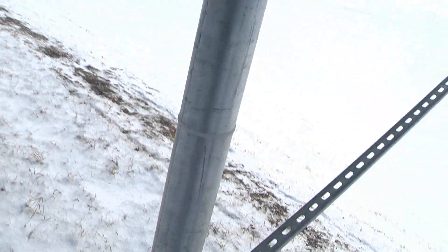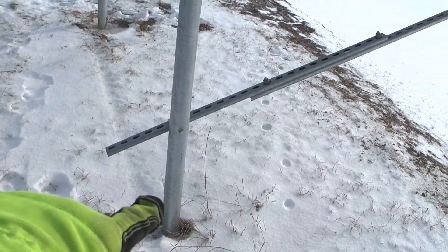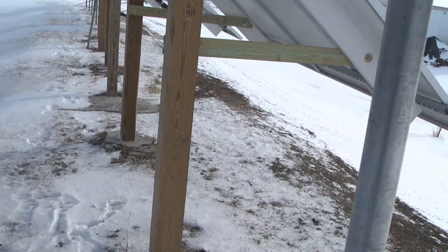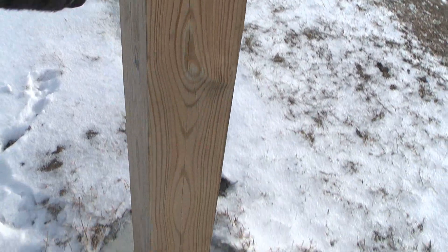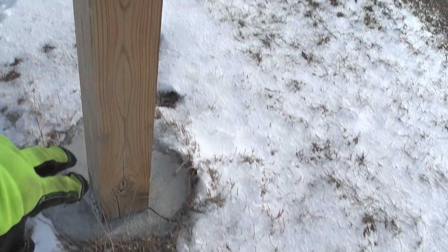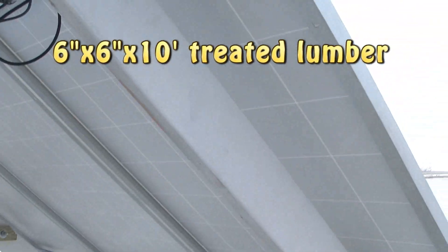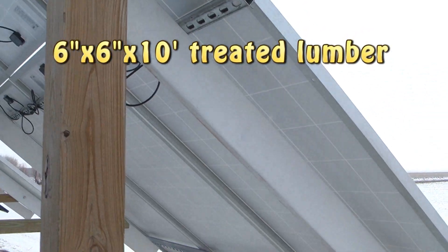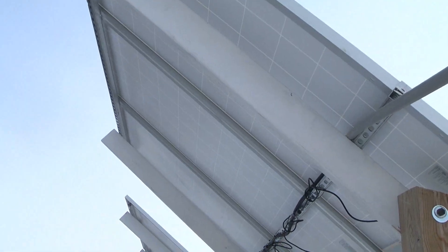I kind of like that idea because these are adjustable. Another two-and-a-half inch heavy wall conduit, but this is a toss-up. I made these — they're six by six treated lumber, ten feet long, three feet buried, all in concrete. Just treated wood going across here, and a twelve-foot two-by-six going up there with the super struts going across, because those always work well.